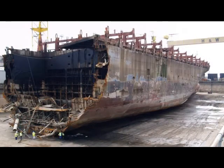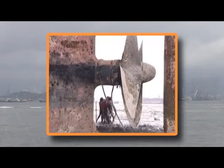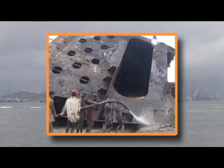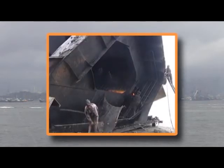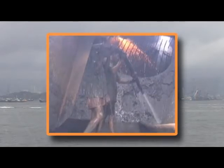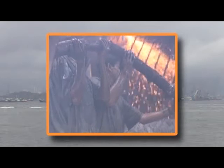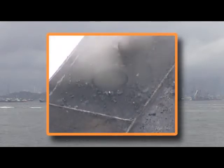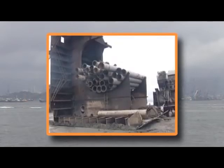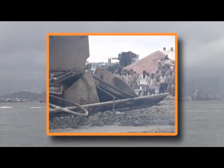A ship is a working asset. So when it comes to be dismantled, up until recently, you are bound to have oily residues, grey water, sewage or water that has been used for sustaining the crew. You also have hazardous materials. For old vessels, some of them still retain asbestos. Some of them have PCBs and all sorts. So for method 1, which is the beaching method, really in terms of environmental hazard, you have the way of dealing with oily residues or polluted waters whilst on a beach.